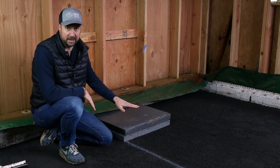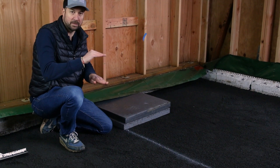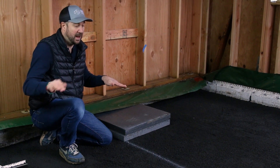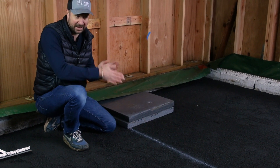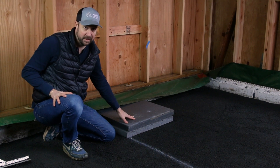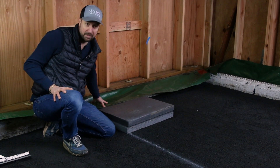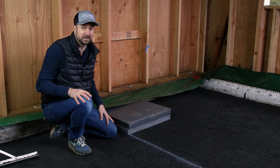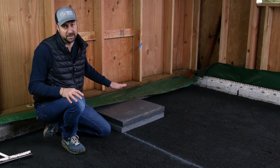What we've got here is our native soils. On top of that we've got about six inches of three-quarter minus gravel with no fines in it — that's our soil gas depressurization field. On top of that we've put some quarter-minus gravel to give us a nice flat surface to set our insulation layer, which is the foam we're showing right here. On top of that layer we're going to be putting our air barrier vapor barrier with this polyethylene sheet, and then on top of that two layers of three-quarter inch plywood, which creates our subfloor, and on top of that we'll install the finished floor.